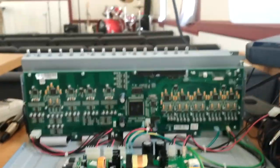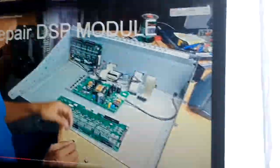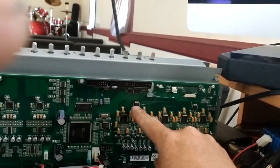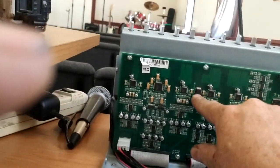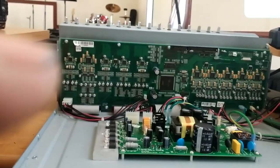We can see that this is the 16-channel, so it only has one complete board in the back instead of two, like what's on his. But we can still see that it's this one, this one, and this one here. So we're going to unsolder those, and then hopefully it'll work.